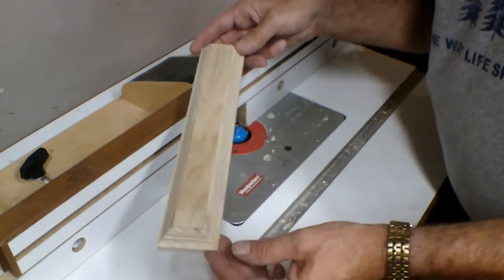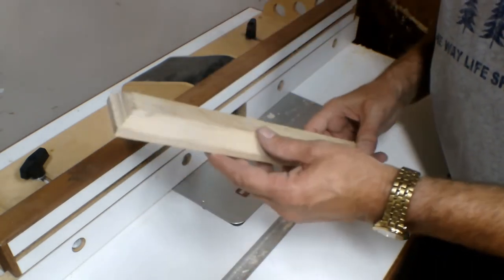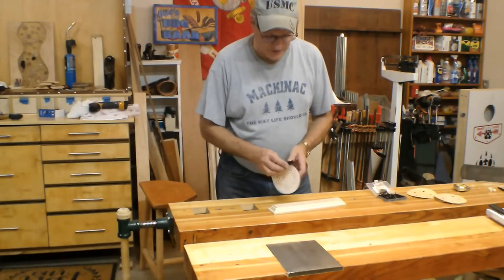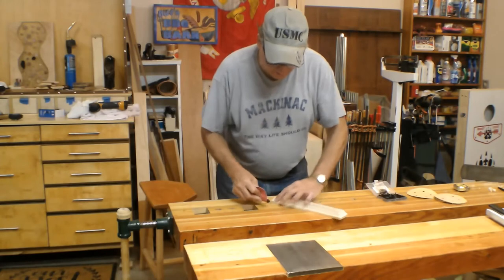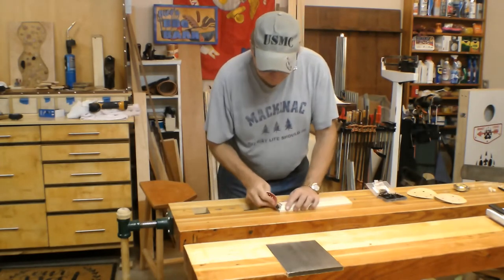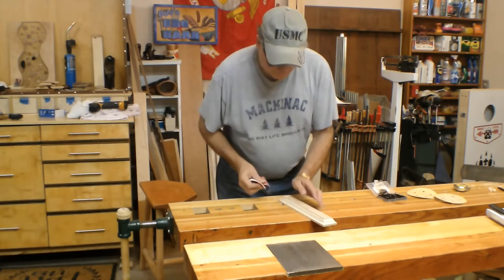And there we have it — it's looking pretty good. A little bit of sanding, take out some of the rough spots, and we should be golden. I'm sticking on my favorite 220 grit. I'm going to wrap it around a pen just because that's what the curve is here. It works out pretty nice — really quick sand with 220.